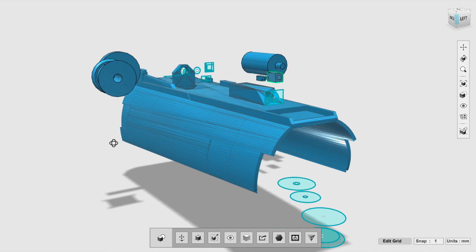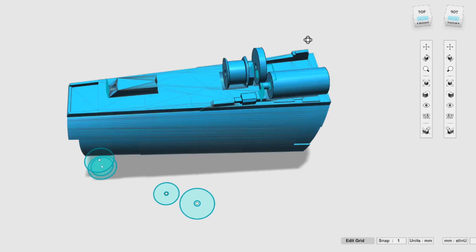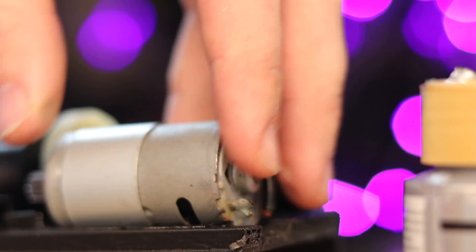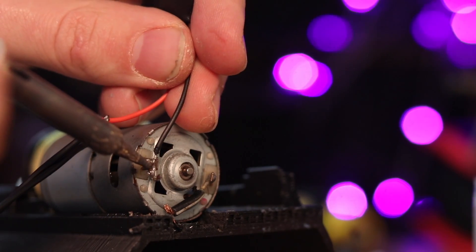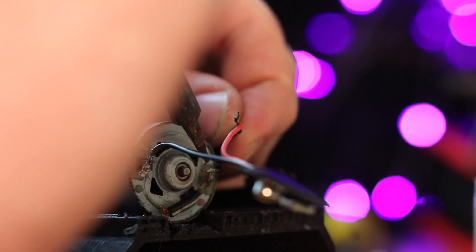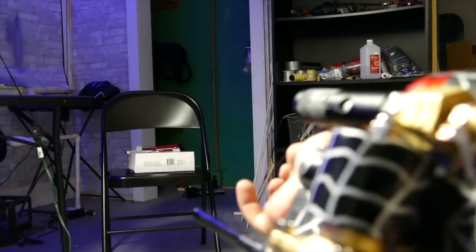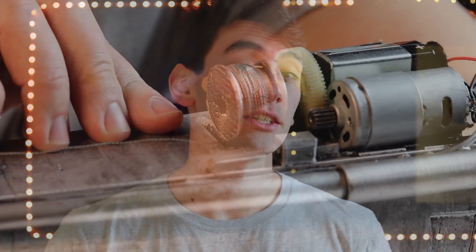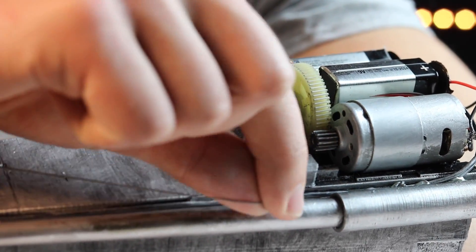Back to the CAD model — I'm thinking we'll have a pulley attached to a geared electric motor, with a built-in loop mechanism for the string to travel through when winding it up, and when we take it out of that loop, the string winds off the pulley freely. This is basically how a fishing reel works. I actually already built a similar device that shoots and retracts a bolt using a real fishing reel — I'll link that below, along with related previous videos. This time I built the reel mechanism right into the 3D model, printed and assembled it, and painted it.